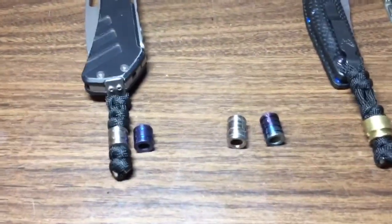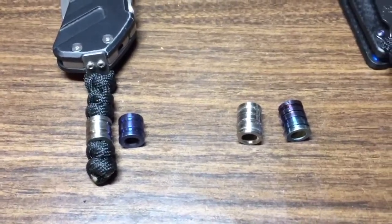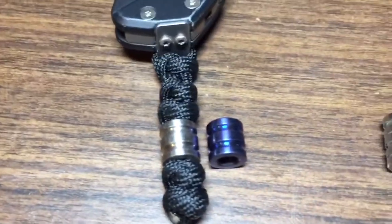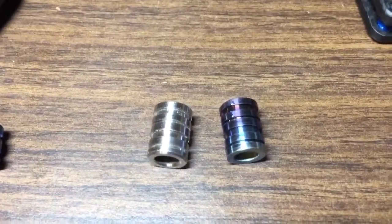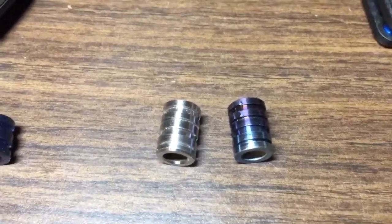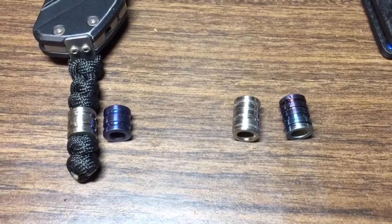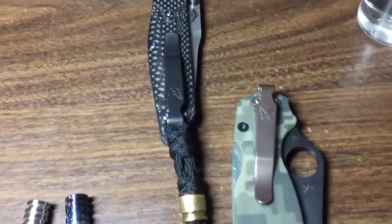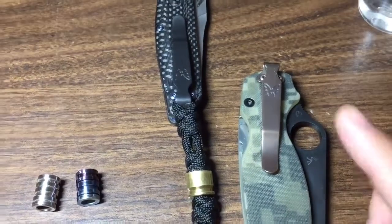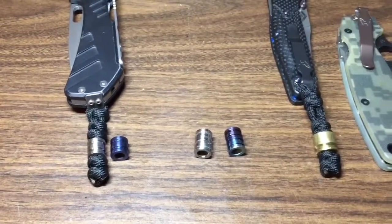Before I finish this video I just want to show you one more thing — these are titanium beads. All four of them used to be the same exact color. These two beads used to be exactly the same and now one is blue. These two beads also used to be exactly the same, and on this one I did a little more heat towards the bottom and a little less towards the top, so it's got purple up top and blue down the bottom. As you can see, for titanium you get much more vibrant colors with heat anodizing. I also wanted to apologize about the Benchmade clip on the Spyderco knife — I'm sure some of you knife guys are cringing, but it was a cheap way to get a deep-carry clip on a Spyderco. Took a little adjusting of the holes but got it on there. If you guys have any questions or comments, post down below and thanks for watching.